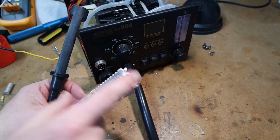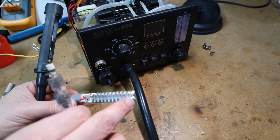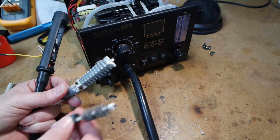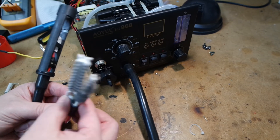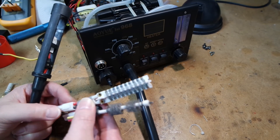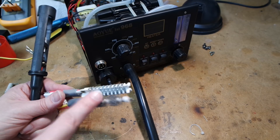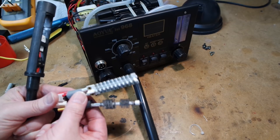There's a K-type sensor on the top of both of them. On this one it's not really in the airflow — let's see how that works out. They're exactly the same length and I would say they have the same diameter. Possibly this old one would have been better from a heating perspective and this new one will be better regarding the airflow.